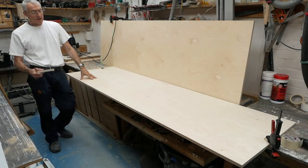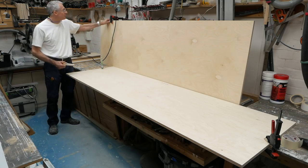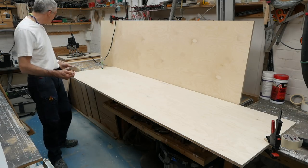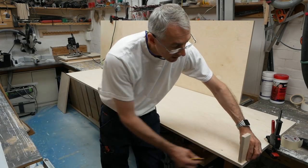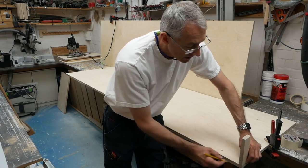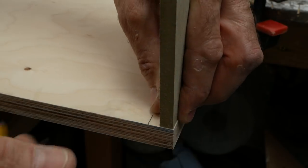So I've turned this board over — this is the base — so we've got the right edge to cut the rebate in. In the interest of health and safety, I'll put a clamp on this to be sure it won't wobble around. The only fiddly bit is that at the ends the sides sit in-board, so you don't want the rebate going all the way to the ends because that would just look ridiculous. We want it stopping at 9mm from the end so the rebate continues around nicely.